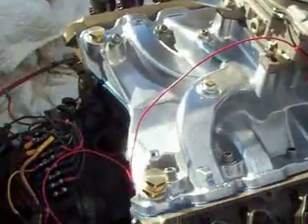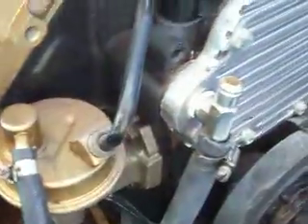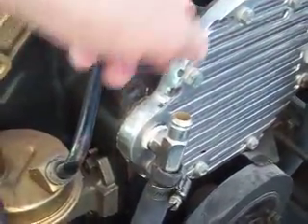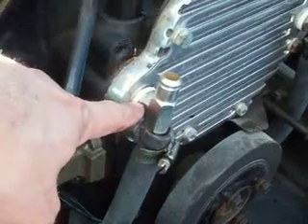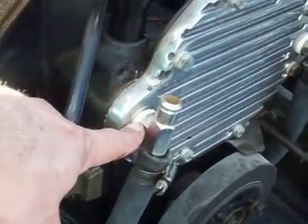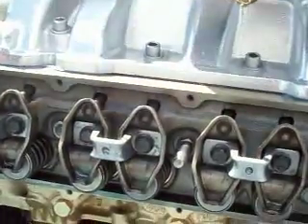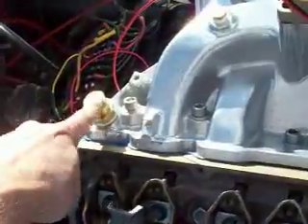At least everything's installed on there now, but I am going to route the water in the back ends of the intake manifold, unlike the way this thing was originally routed. It was routed up from the bottom up to these, and then these guys go up to here, and then these go down to the exhaust manifolds. The problem is when you turn the engine off, everything drains down to this level, and so the whole top of the engine has got air inside, and it really oxidizes the heck out of everything. So these guys are going to get blocked off. Water's going to come in the intake manifold here, fill up the engine, and when it's full it bypasses because the T is right here, and then it's going to run all the way up around here and go up into this guy. We'll see how that goes — I think it's going to keep the heads a lot cooler.